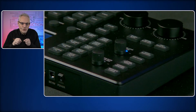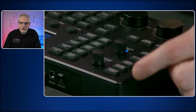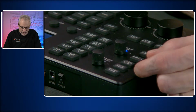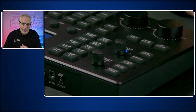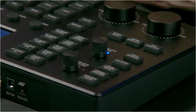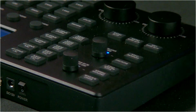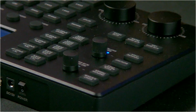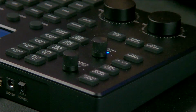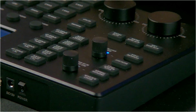are all the actual camera settings. So whatever camera that you have selected, you can do things to tweak the red and blue levels inside the image. You can do one push for white balance, so hold up a white balance card and put a one push trigger to set the white balance. You can also just loop through a set of preset white balances, again, making it easier. If you don't have the time, you can get close to proper white balance in a more high-paced production situation.